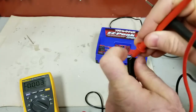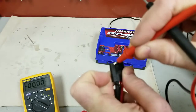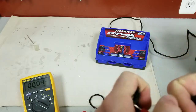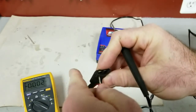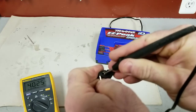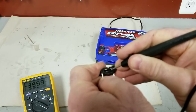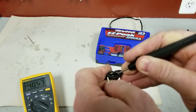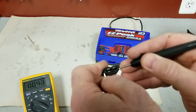And if I want to read the individual cells, I'll just need to go in here and tap into that corner plug that I showed you earlier. Polarity doesn't really matter because you'll just get a reverse sign. Now you can just go ahead and check one side — I measure 4.025 volts on one cell, and then the other cell is 4.057.